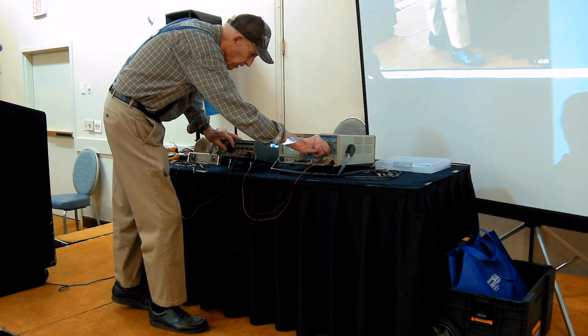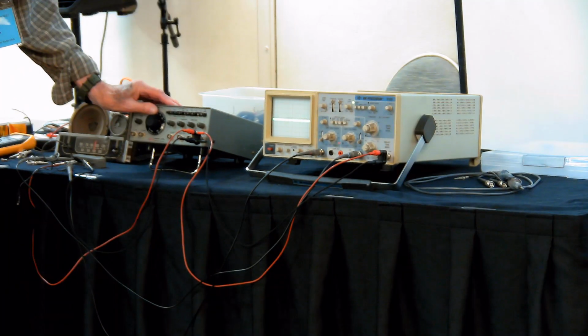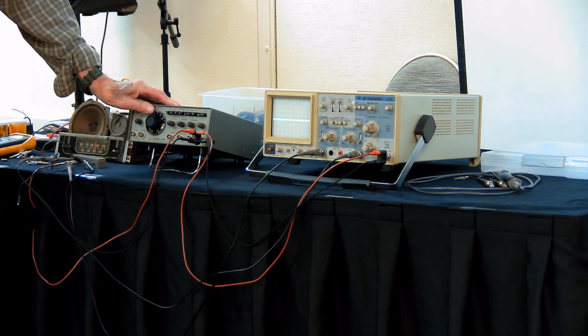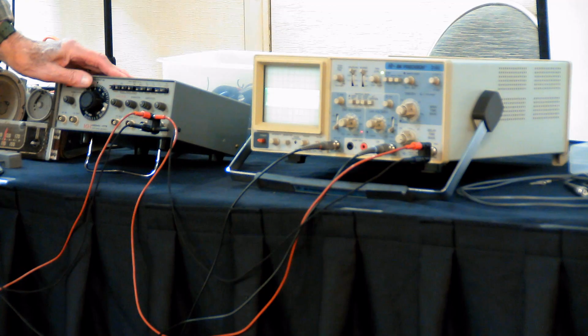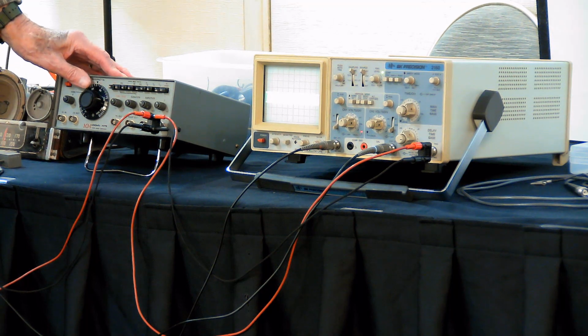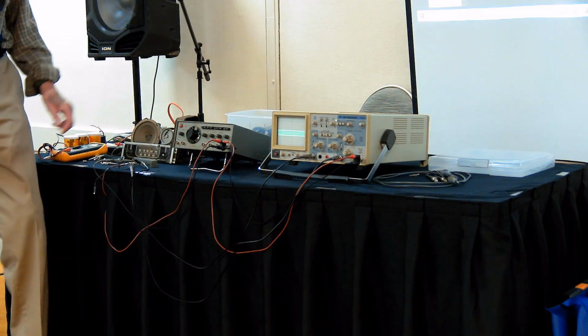Now it's interesting to look to see if there's any lower frequency where that occurs. It looks like there is not. That's the first place it occurs. Now it should occur as I go to higher frequencies, because the higher the frequency, the more often you'll pass through another null. There's another null. There's another one. Not quite as good, which means that there's enough distortion in a waveform going through this line that any of the distortion shows up as a result.